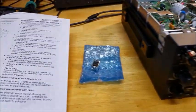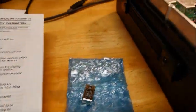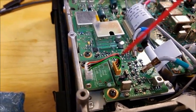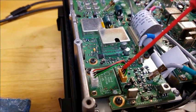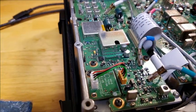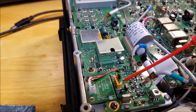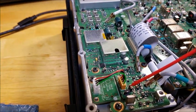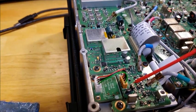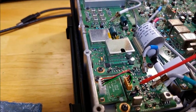Here is my SO3 oscillator, and it's going to be placed right over here. I'm going to pull that out — you see the little square right there with that plug. Also, if you notice, there are two jumpers here. Those have to come out of the circuit, so what I do is lift one leg up and just leave them on the other leg so they're there but not connected — they're not jumpering the two pins.